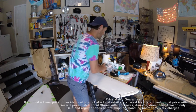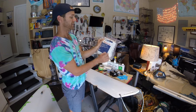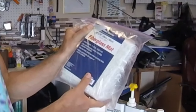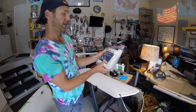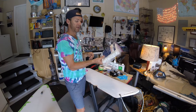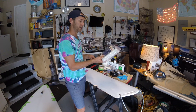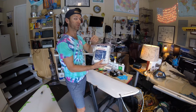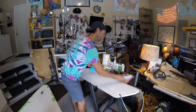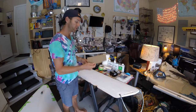The fiberglass we're using today is a West Marine fiberglass mat — heavyweight, one and a half ounce, 42 gram mat, compatible with all marine resins, 38 by 34 inches. I've been using this roll for about a year and a half and haven't gone through it. It's pretty expensive — about 60 to 70 bucks — and you can't price-match it since it's a West Marine product. Also grab rubber gloves.